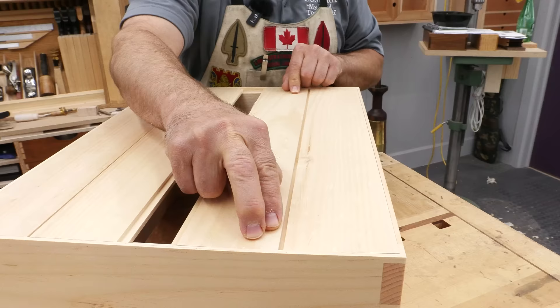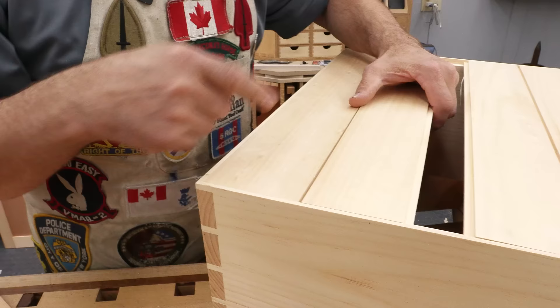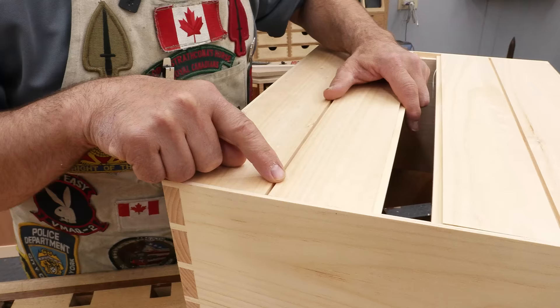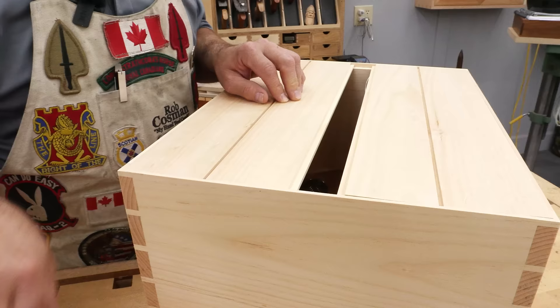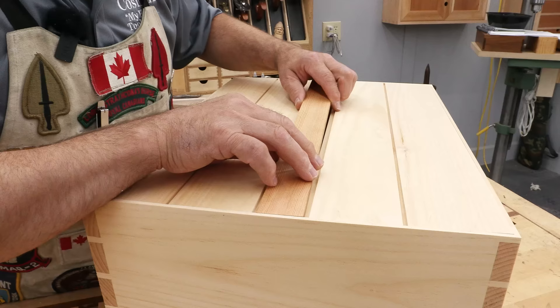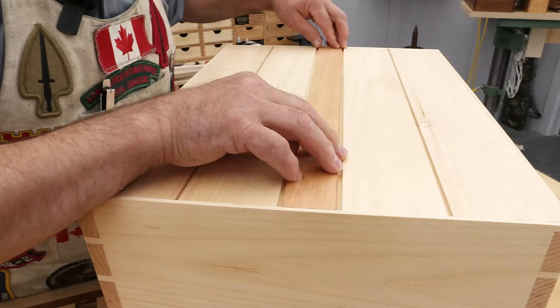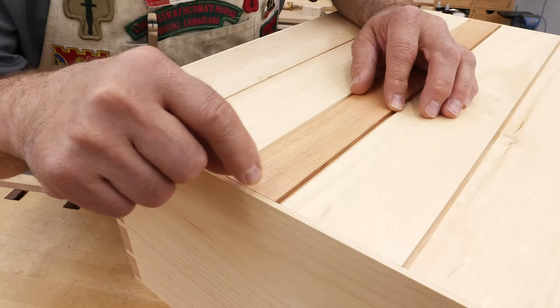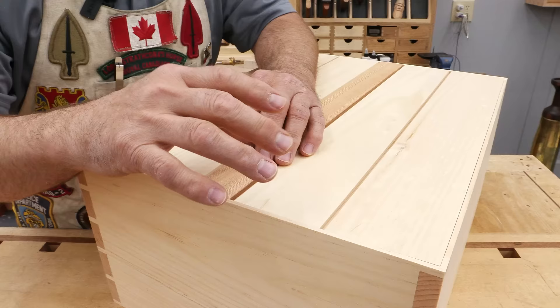So then we're going to take the next piece and lay that rabbet opposite of this rabbet - it's going to sit there like that. You can see that the gap is going to be the same. When I put it in here and put it tight, there's no room. When I move it over like this, you now have approximately an eighth of an inch of movement. So we'll put one nail right here, not touching this one, and one down here. That's going to hold this piece fast, and the rabbet is going to keep this one nice and tight. All the movement will go that way.